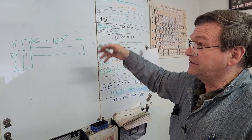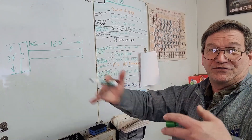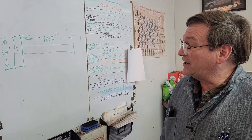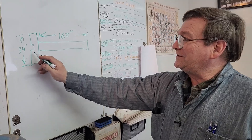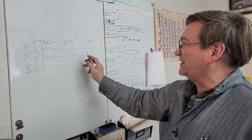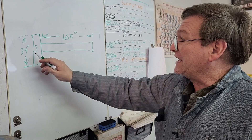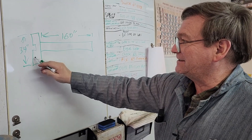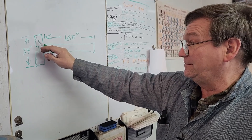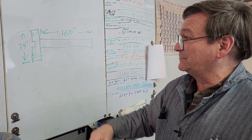The outside of this assembly held a whole bunch of auger flights. When this was in place it was five or six feet in diameter with augers that were screwing things up. So this was the smaller part of the whole operation, but the job was, as I say, to face this face several times. We'd come in here and build up areas for bearings and different things on the shaft, but we had to fix this face — these were getting eroded away and beat up.